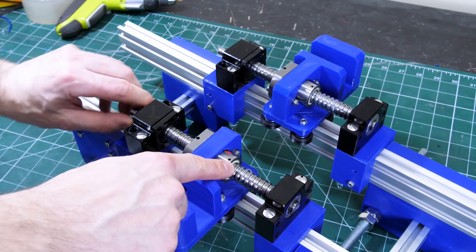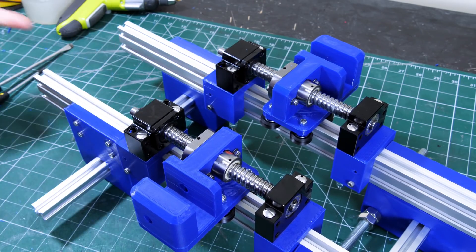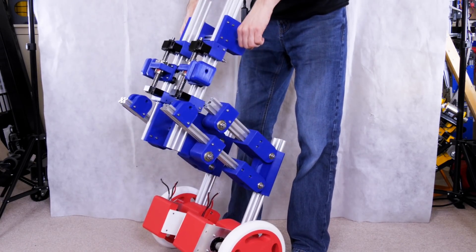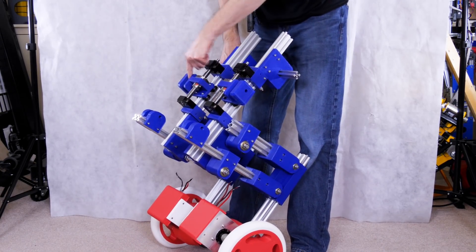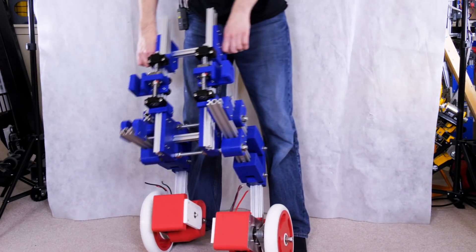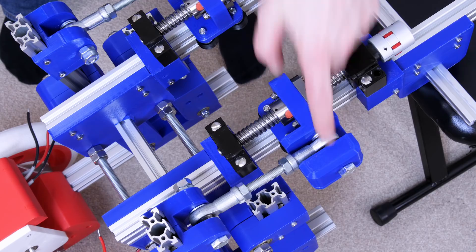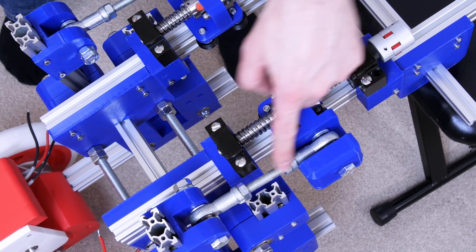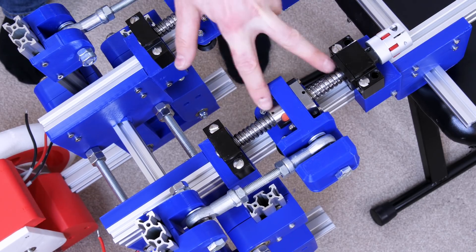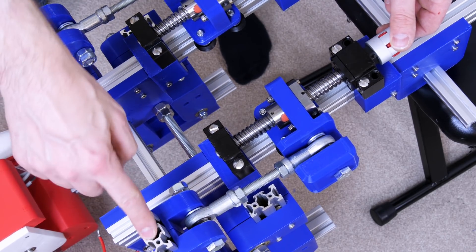These are 16-05 ball screws, meaning every turn is 5mm and they're 16mm in diameter. Running on 48 volts with a brushless motor coupled directly, these should go four times faster than the OpenDog actuators. We've got our mechanism that lifts up and down, and with rods on each side pushing and pulling, it can bend up and down and lean side to side as it goes around corners. Helpfully, it can also sit down when not balancing so I can turn it off and it won't fall over.